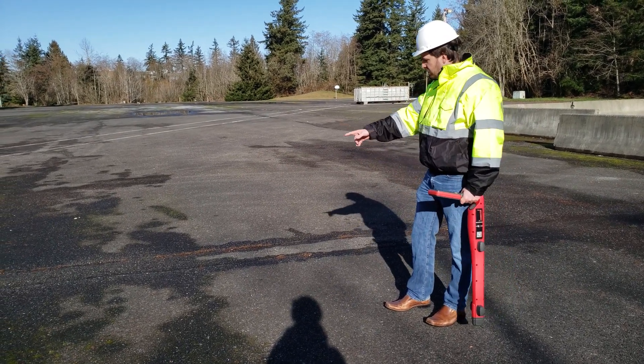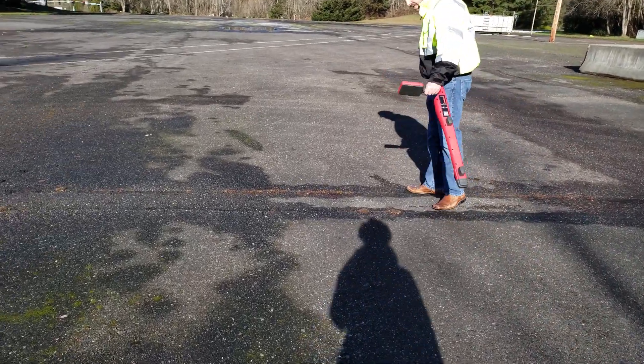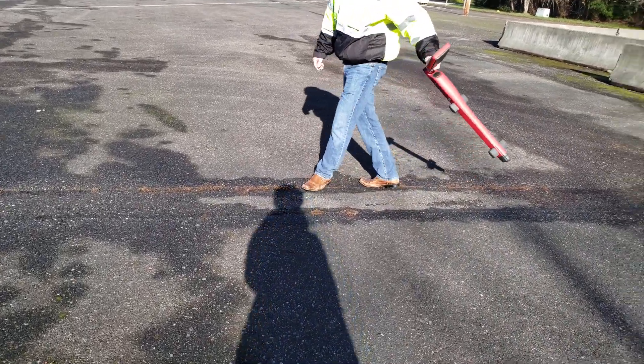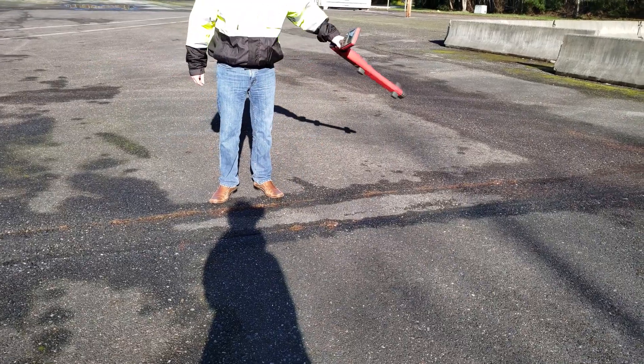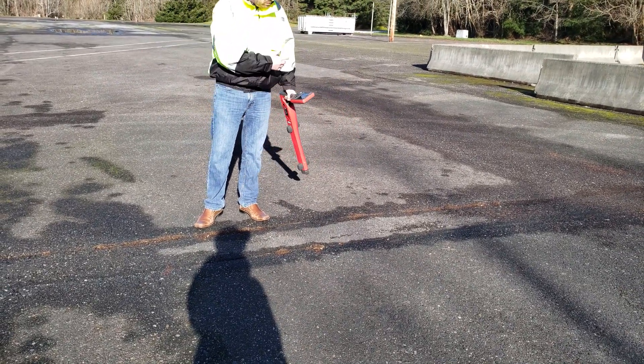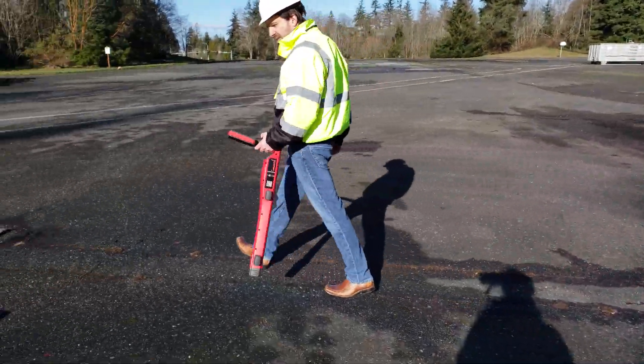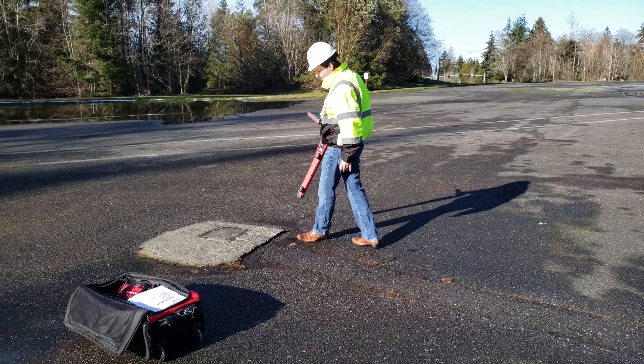The way we know this is that if you notice the asphalt layer, there's a small irregularity here in the surface. This is an asphalt patch — probably when the water pipe was deployed or maybe it was fixed, this area was revamped with asphalt. Look at this also; this is another key clue when you want to detect utilities.